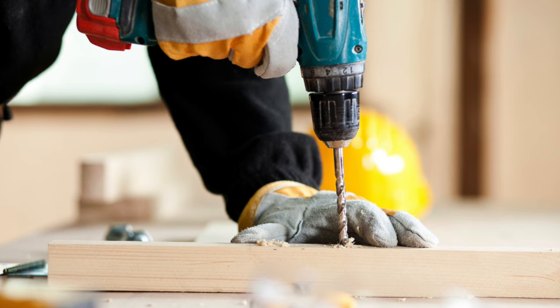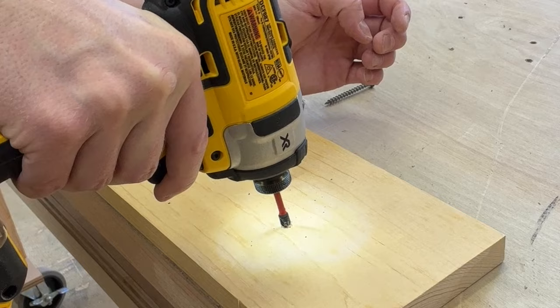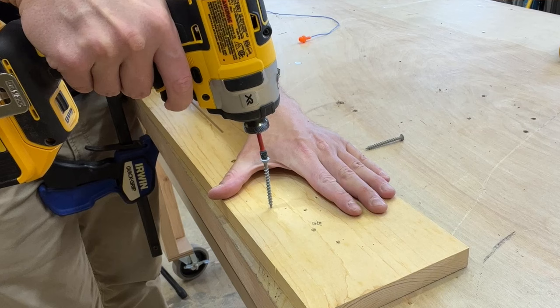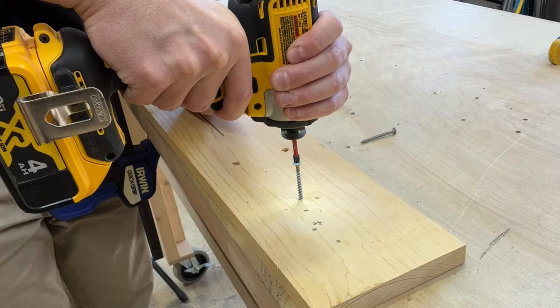Number seven: drill bit punching. This is one of the most common injuries in construction. Be careful with your free hand when driving a fastener. Screws are very unstable, especially when you're just starting to drive them — they wobble and sway until lodged in the wood. Even once lodged, angled pressure can cause your bit to jump out violently. If your free hand is near the fastener, you'll most likely punch it with the driver bit. These things don't look sharp, but when you're bearing down with your weight, they're sharp enough to break skin. I've had little star-shaped puncture wounds in the fat of my thumb from this. Keep both hands in contact with the screw and drill until it's fully set, then keep your free hand clear. Be mindful of where the driver bit wants to go if it slips.